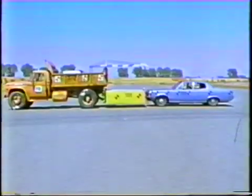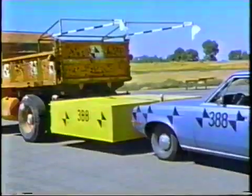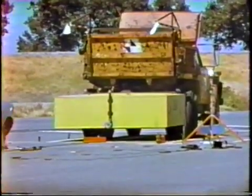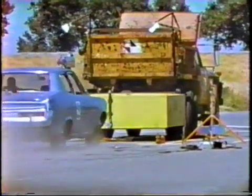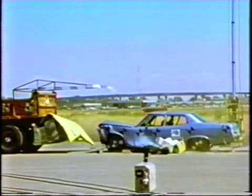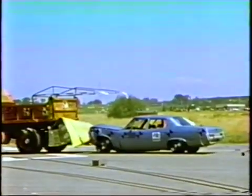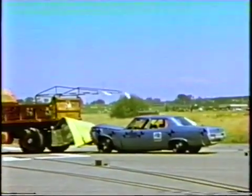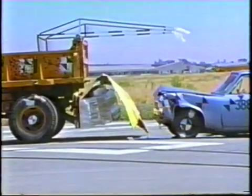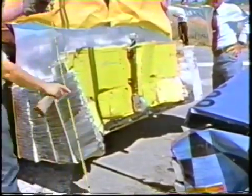Test 388 was a continuation of testing of the redesigned mounting hardware, with modifications to allow more crush of the attenuator as illustrated in test 387, using a 4,200-pound 1972 Matador. The hardware performed excellently, once again sustaining no damage. The occupant impact velocity was 23 miles per hour after a car impact speed of 46 miles per hour. The truck was not damaged, but the grille of the car was crushed back 11 inches. This successful test proved the capability of the attenuator to handle heavy car impacts.